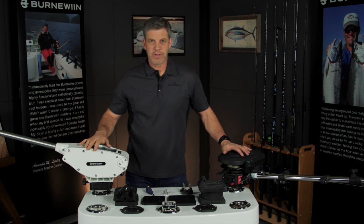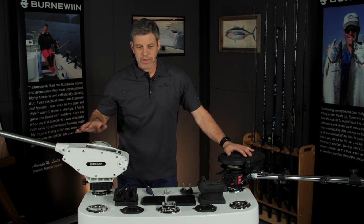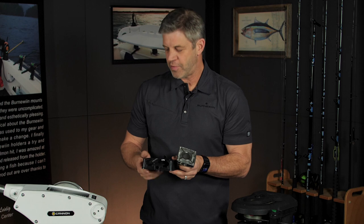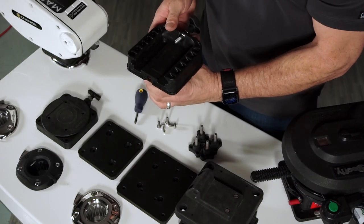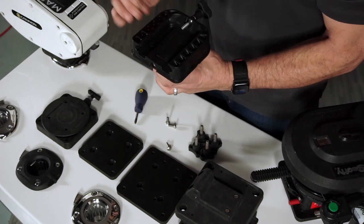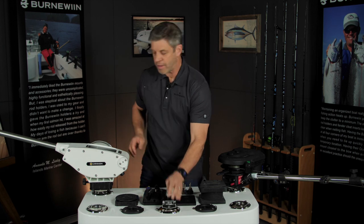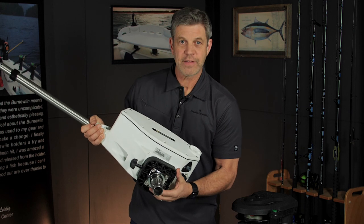The difference between the two is that if you're doing that type of setup with the Cannon, you don't need any adapter plates at all. This is the UM6080, and Cannon's what we refer to as their dovetail base — which is what's on here right now — bolts directly to the UM6080 with the four fasteners that came with the UM6080. So once you screw this in, you just slide the downrigger in and fasten it on. You can see here that's a really simple, clean setup.